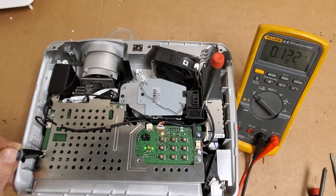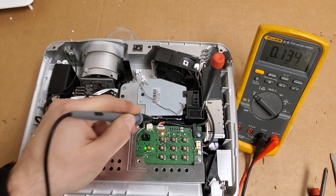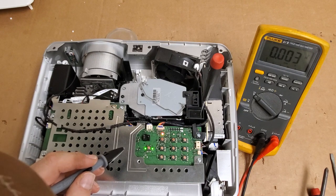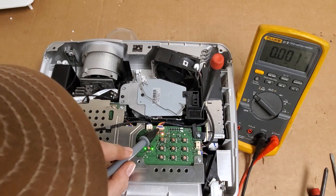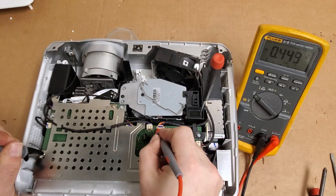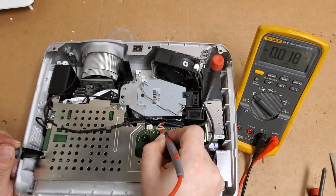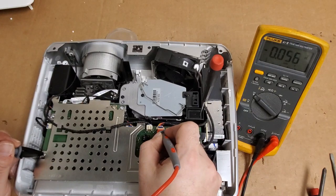What we'll do next is we'll fire up the projector, and then we'll see what we have going on the ballast TTL output here. Let's see, we have yellow, orange, red, brown, black. So we'll start with, let's see, do we have anything? One of these is power into the optocouplers, and the rest of these sync. The power comes back and is synced from the optocoupler.